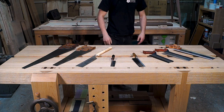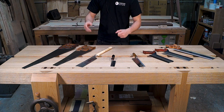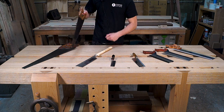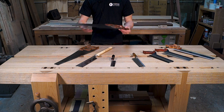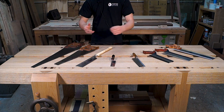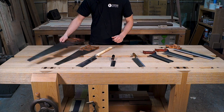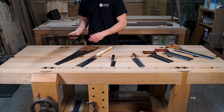For me, I have band saws and table saws available, so I don't usually find a use for panel saws. The only time I needed one was when cutting rough timber to length and my pullover saw couldn't quite reach far enough, so I had to finish off with the cross cut saw. It's also worth saying you can get these in different tooth patterns — a finer rip saw won't chew up the timber as much. I don't generally have a massive need for panel saws but I like to keep them on hand.